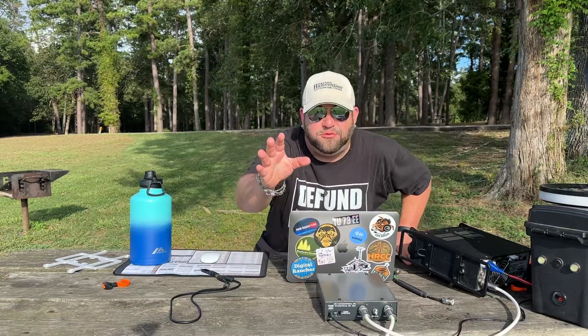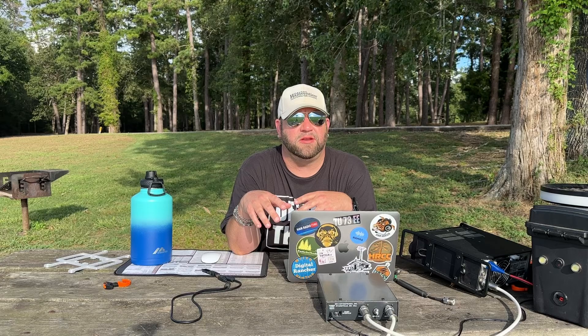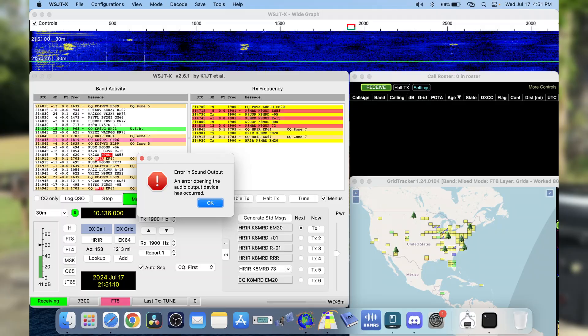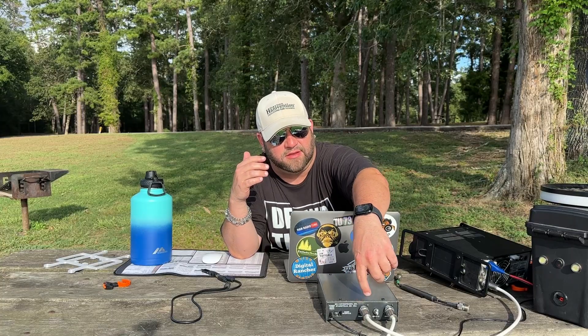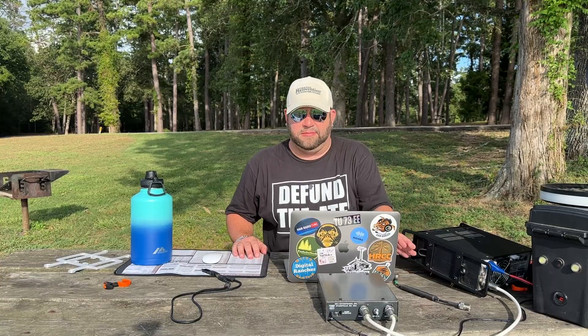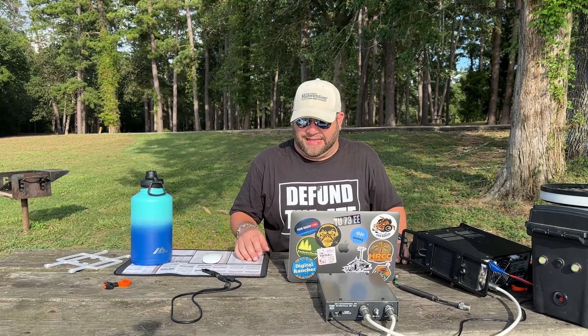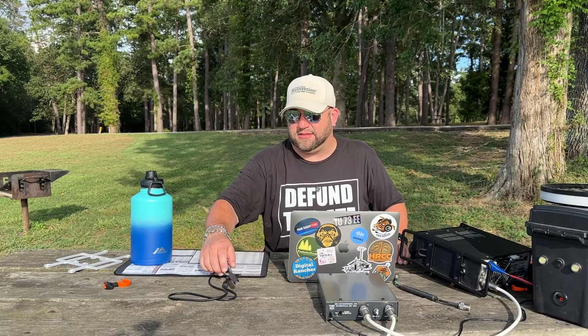After action report. I don't film the on-the-air stuff because the analytics say that everybody tunes off once I start getting on the air. But holy crap, I made a lot of contacts. I started off tuning around a bit on digital modes, just kind of checking the bands. I got a few contacts on 10 meter FT8, and I was having some problems — that audio error thing. I took this choke and put it everywhere I could think of: at the radio, at the antenna, at the radio part of the tuner. I kind of suspect it might be this cable, but I use this with all kinds of other antennas and I don't have any issues.